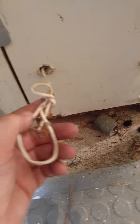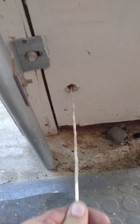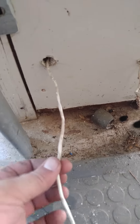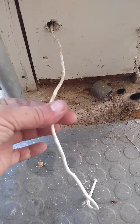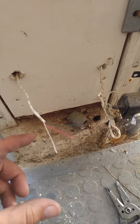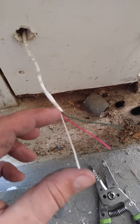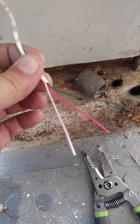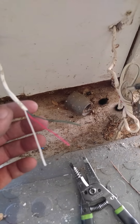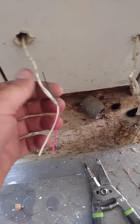Now that we're over here, here's our pre-wire that's behind the wall, which goes back to the machine up in the ceiling. You want to pull this out — I don't want to cut it too high up, I want to leave some, so I'll choose about right here and snip this portion off. Once I trimmed it back, I stripped it just enough and pulled off the casing. Now I've got three wires here, but the safety sensor requires only two. I personally like to use white and red; the green one we can just fold back, cut it off, or wrap it around.